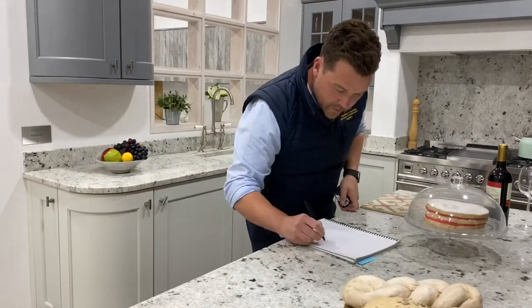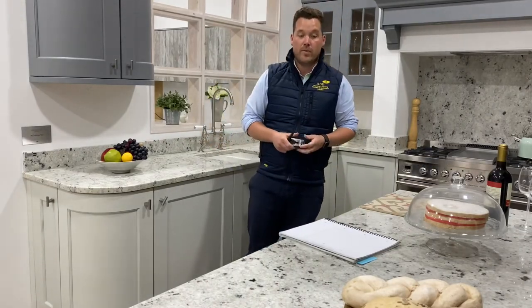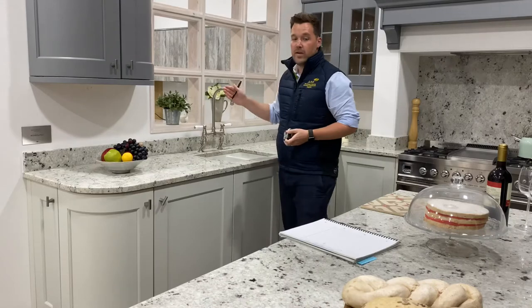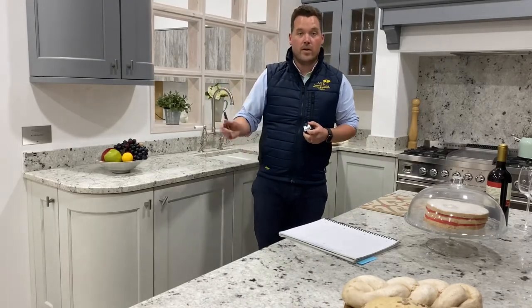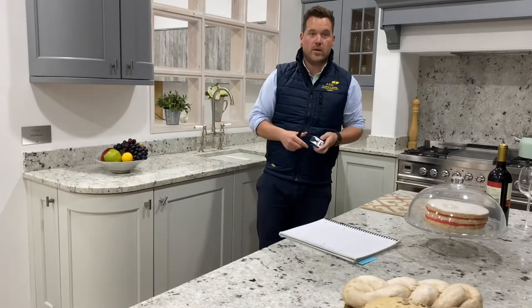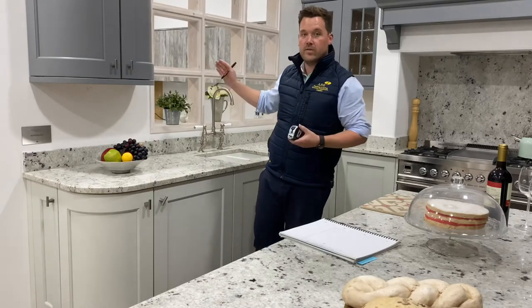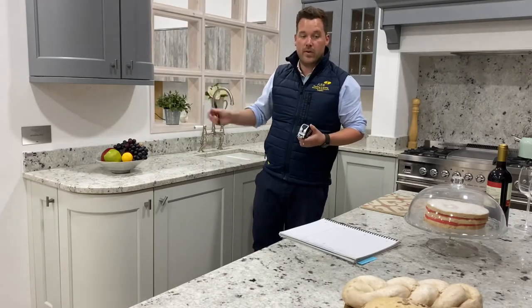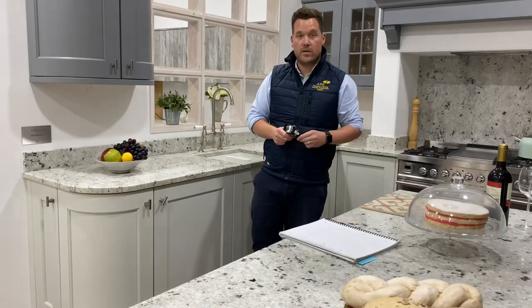The reason why we take a total wall or room dimension is purely because if you add those three measurements up, generally speaking, they should add up to roughly the wall dimension. We know that windows aren't square, door reveals aren't square — they look pretty square, but they're generally not. It just gives us a really good guide that we've got the three dimensions correct, and the window position, by measuring the left-hand and right-hand sides. Same applies to windows, doors, archways, anything like that.